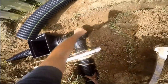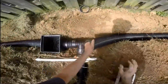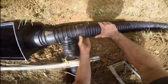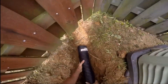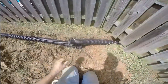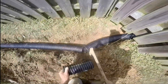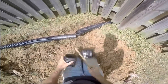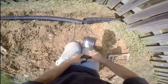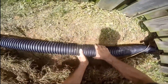Don't be afraid to get down on your knees. A lot of people see workers and don't want to get dirty, but this is a job where you're working in the dirt — wear some old pants, don't be afraid to get down in that dirt, it's just soil. Continue to lay more pipe; remember, this just snaps together. Really simple job. Once you've got your trench installed, the hard work of course is always trenching — the groundwork, the prep work. Here we're out at the sidewalk. I like to cut off about four or six inches of pipe and split it in half, then push and squeeze it together so it acts as an insert. Slide it into one side and it expands and snaps tight, put the next side in, push and hold it, and it snaps tight and you're done.